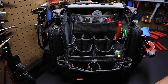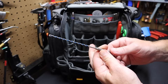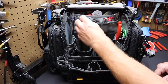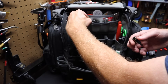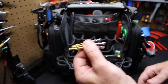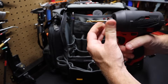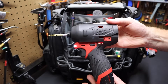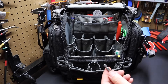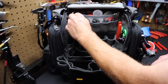Speaking of drill bits, I keep an assortment — just a few in here. One is a longer concrete drill bit that came in handy once and I kept it as a standard concrete bit. I've got three drill bits up here, usually to drill pilot holes — just some standard bits to have something in the bag. Notably, all of these have a hex base so they can fit right into the impact. So I can use the impact as either a drill or an impact driver — that's why they're all hex. And of course they'll also fit into a standard drill.